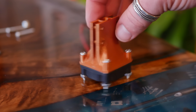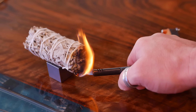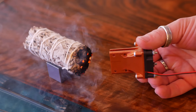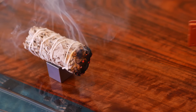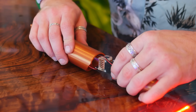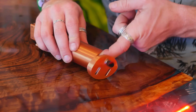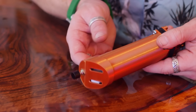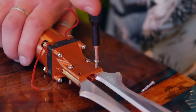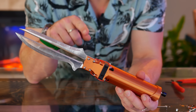This is the forced air component — a critical piece holding the handle, fan, and blades together while providing airflow. The little fan didn't produce much flow, but maybe it would work. I slid the electronics into the handle, which was designed to draw air past the electronics for cooling — you can see the intake vents on the back. Both blades popped right into their design spaces, and with the addition of two bolts each, they're locked in place. This blade is pretty much complete.